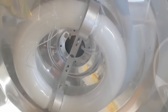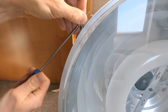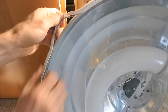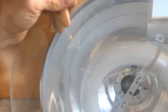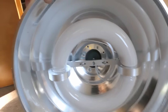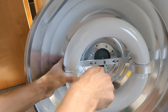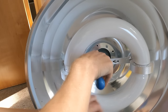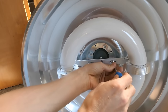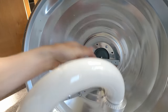It has a glass cover held on by basically just one screw. Let's unscrew it. The glass comes off and here is the tube. In this one a wire is loose; in the other ones it's on the back of the tube. The tube is mounted on two screws and seems to have some ferrite rings around it in aluminum covers and shieldings. Now the tube is unscrewed and it's on just two wires going into the power supply.